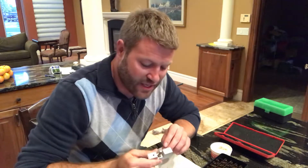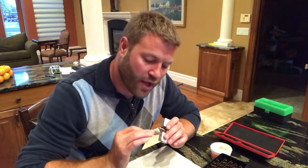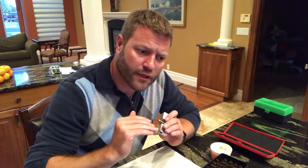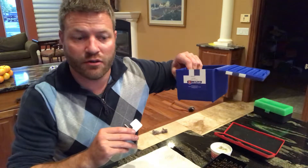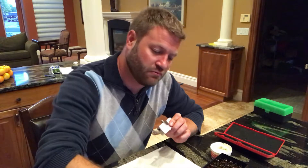Hey guys, Taylor here. This is the second video in a series for precision ammo reloading. Right now we're on case prep — last time we did primer pocket prep, this time we'll do neck turning. We're not going to cover case trimming because I just got these new Lapua 308 cases and they are within a thou — I've got 2.009 and 2.010 for my lengths, so there's no need. When they expand a little bit I'll make another video on case trimming if you want.